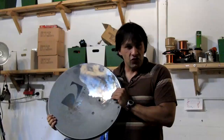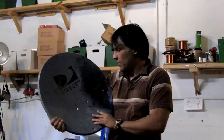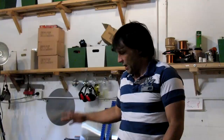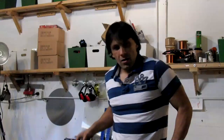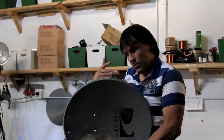There are chemical strippers out there that may be able to do this job. If anybody has any suggestions or has success stripping this paint off, feel free to post a comment and share it with everybody — that way they can avoid scraping and scratching the surface because this stuff is very difficult to get off. If you do go the bench buffer route, you definitely want to be outside when you do it. Wear a respirator mask and wear some gloves because that stuff's not good to have around — you're getting metal particles, paint particles, and compounds everywhere.